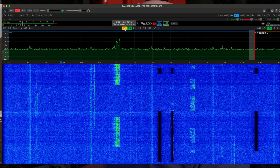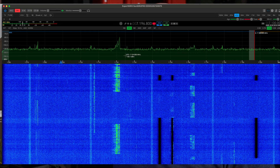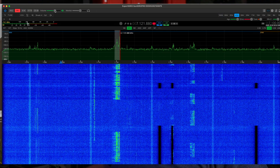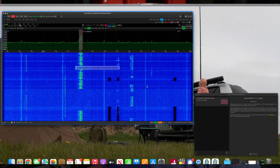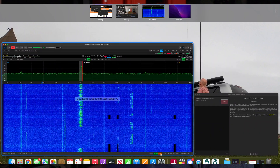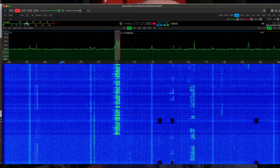I quite like the choices on filtering and noise reduction. There's a blanker, and I like the binaural sound — it really separates and gives the audio more chance to separate from the noise. It does something with the phase which gives you a little bit more clarity on the spoken word. The noise reduction is rather limited though — when it comes on it really takes out a lot of the signal as well, so I'm not a big fan of that. You've also got notch and peak filters, and additional notch filters you can really tune right down, plus the ability to change the Q of the filter.